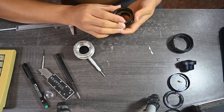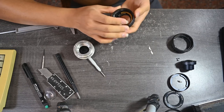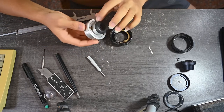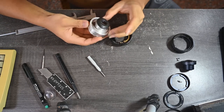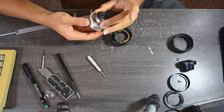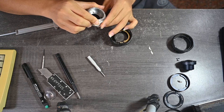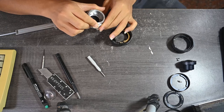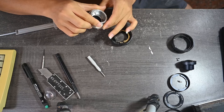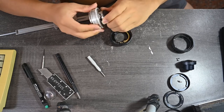Now if you can see this, it does not move, this aperture hand right here. This thing likes to go back, which means that it should close, or I mean, it should close more than opening. And for some reason, these blades are not opening right now. They were open, then now they're closed, but they can't open anymore. What is wrong with these blades? Let's just open the rearmost group first, yeah.